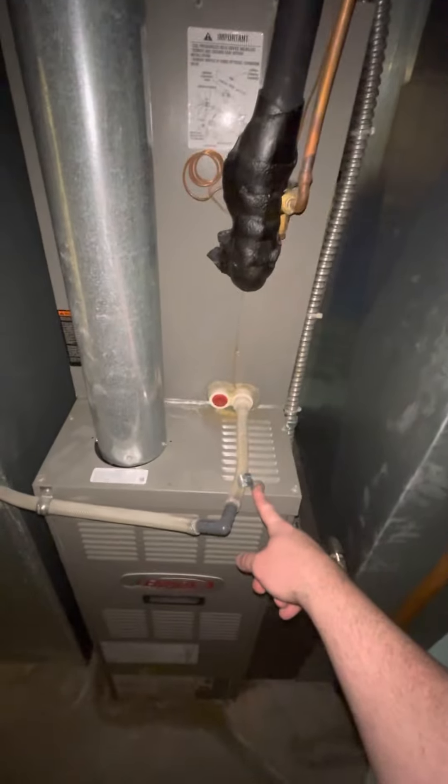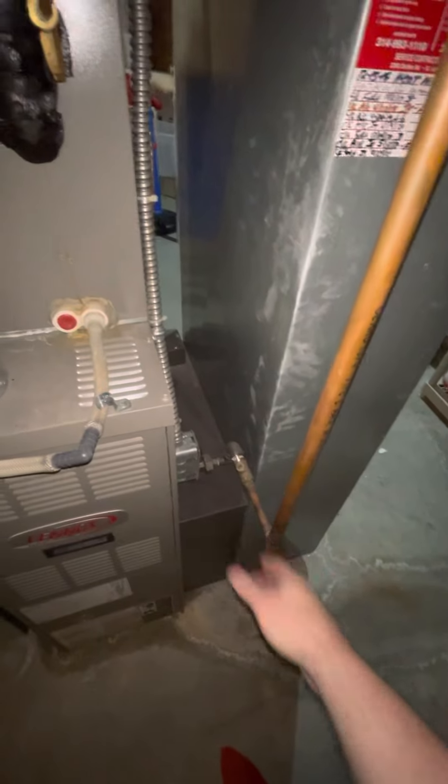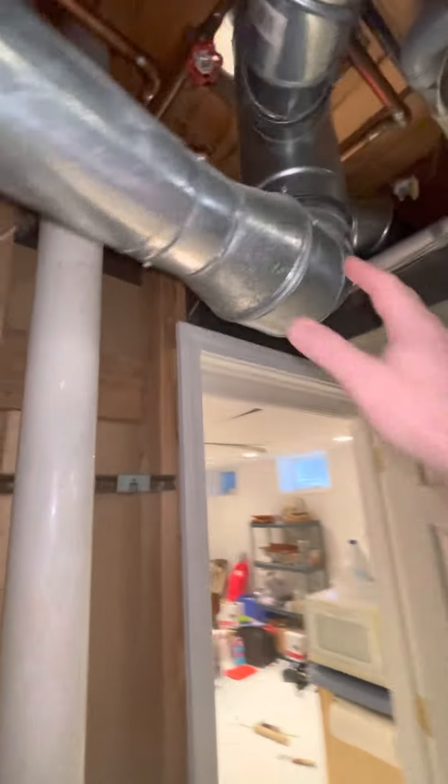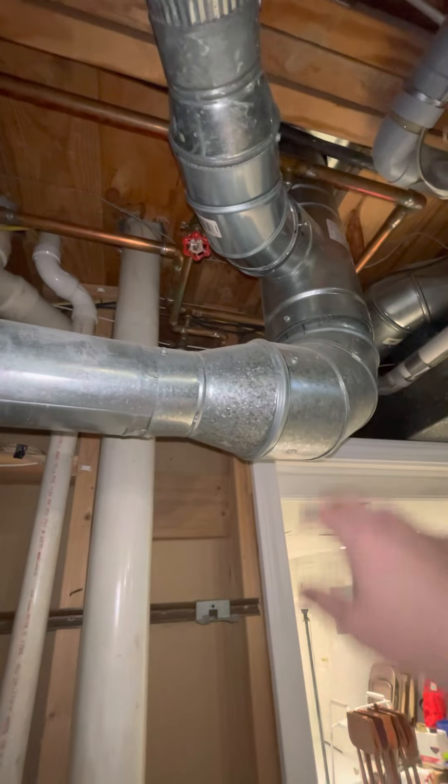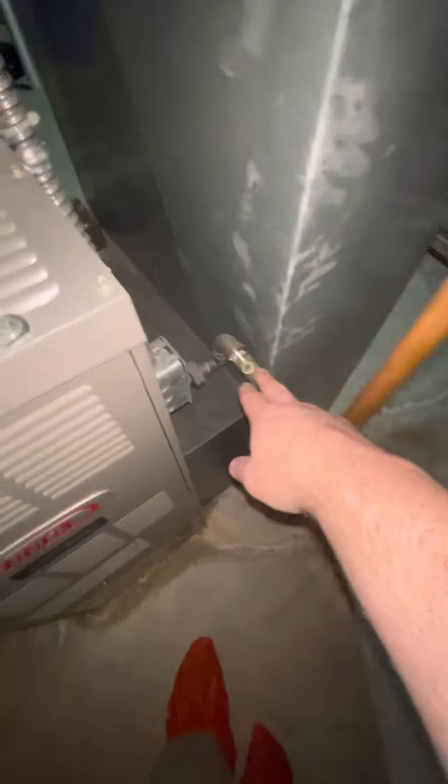If I have to go B-width on this, I might just have us redo this and shrink it down to like an 8 by 25, and that'll give us enough room. We're going to do 12-10 on both of them. This is a four-inch flue — it's a six-inch reducer that it's tying into here. This is the water heater behind me — it's a six-inch reducer down to four. Drains are tied into the floor there; line sets will flush. There's a shutoff and disconnect, and there's no humidifier or anything — the back of these units are pretty clean.